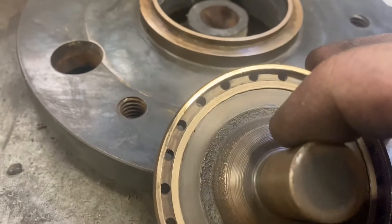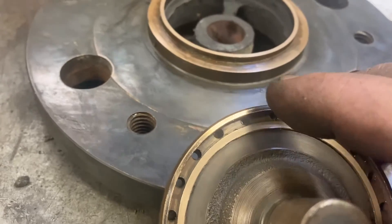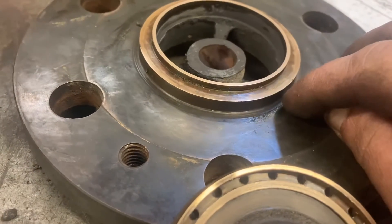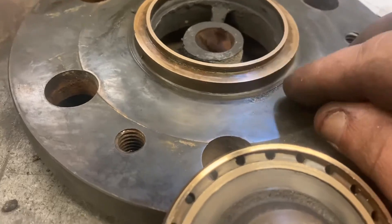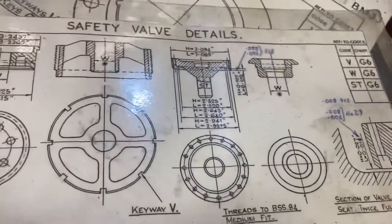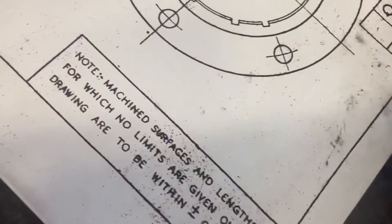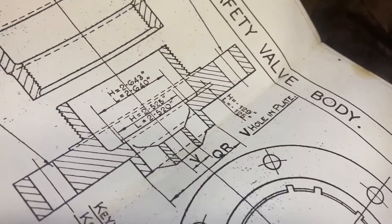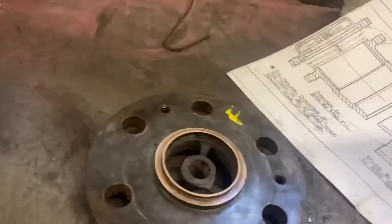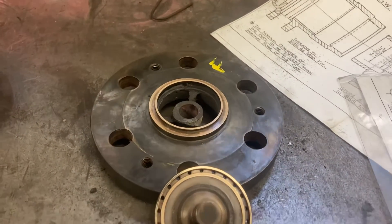The way you do that is set a distance from the valve face to the edge of the skirt, and from the other valve face to the base. You simply measure those with a micrometer and machine them accordingly to set them within a series of tolerances provided on standard drawings. You can see the tolerance range there on the drawing for the valve, and a similar drawing for the base gives the tolerance band. I always try to get them at the high end of the tolerance when machining, so they've got the maximum amount of wear life possible.